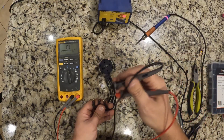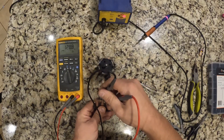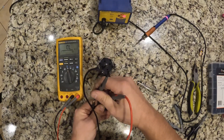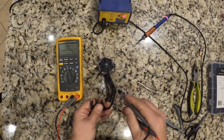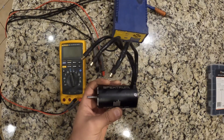You want to go from phase to phase to phase — all phases should read 0.2 ohms. We go here: open. We go here: open. We go here: open. So all three phases are open inside this motor. What we're going to do is open up this motor and see if we can find the problem and possibly fix it.